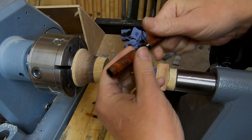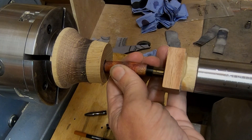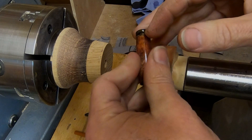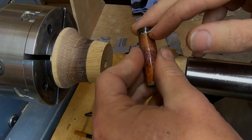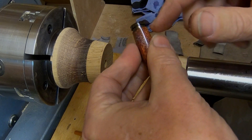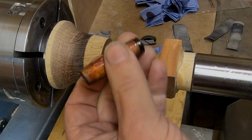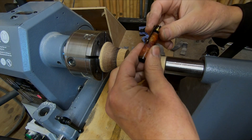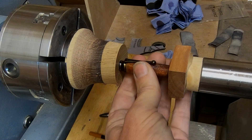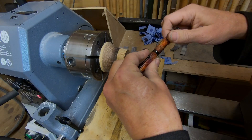Just push that in a bit gently to locate it, then gently undo the pen to keep this in its place and push this bit in. Make sure — hopefully you can see there — that's where all the glue is coming out from the two-part epoxy inside. Sometimes you get overflow from your finish going down the edge of the pen, which just clears up. For your cap you've just got to decide where you want the clip to go.